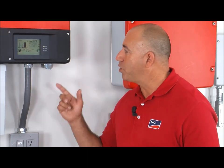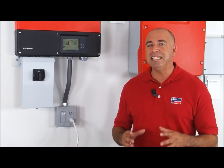Well, when the sun is up and the grid is down, the inverter has a circuit that will send up to 1500 watts to a dedicated outlet with a switch. Now I'm going to show you how easy it is for the homeowner to use the SPS feature.